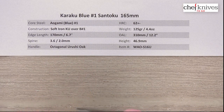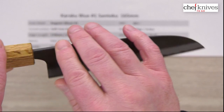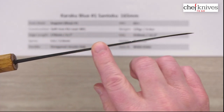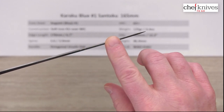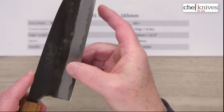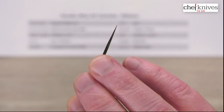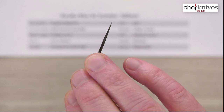The spine thickness — these are fairly thick coming out of the handle but then they thin out pretty quickly. I got about 3.7 millimeters thick on the spine at the back and then about halfway down about 2 millimeters, and it pretty much holds that, even maybe getting slightly thicker towards the tip. But then we get the grind which starts right there — you can see that grind down to the edge. The tip is not super skinny but it thins out pretty well towards the very tip so it should perform quite well.